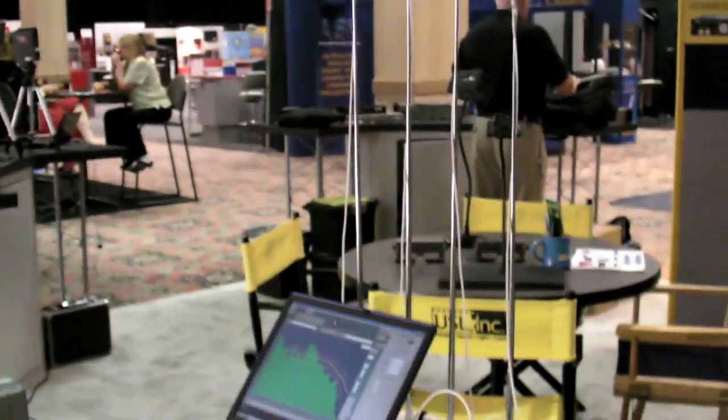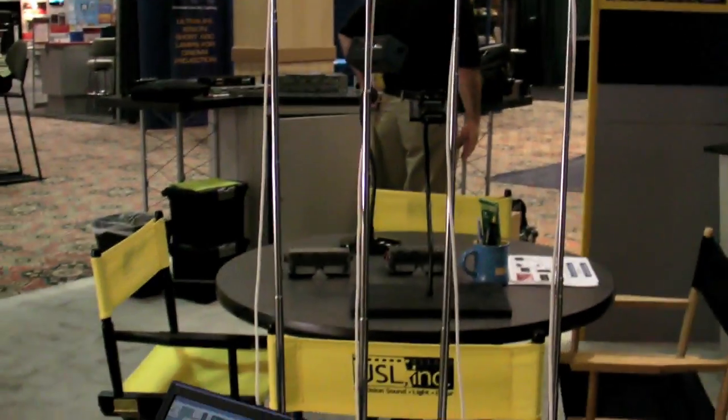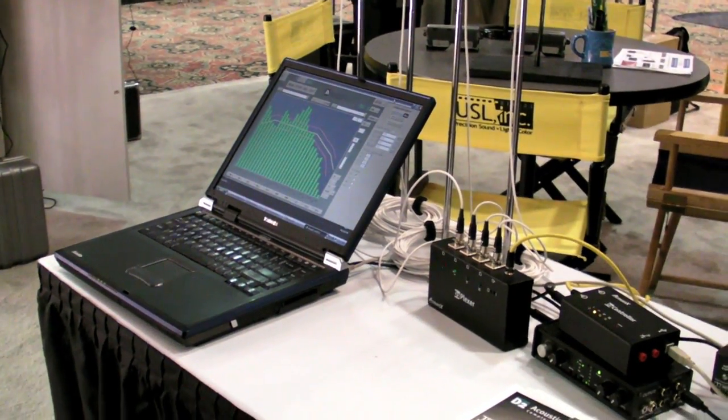Now, quickly looking at this equipment, obviously we've got the computer giving us feedback from the microphones, some sort of box where you plug them all in, and the microphones displayed here. How many microphones do you need, and where do you put them in the cinema? Many studies have been done on this, and the optimum number has been determined to be four microphones. Five microphones doesn't give you a much greater improvement. Three microphones to four is a significant improvement. Microphone one is the keynote microphone, put in the reference position, also called the Dolby position. The other microphones are gain leveled so they have equal contribution to the timbre in the room. If you put them in a diamond array, cornered in the center of the room, and average the pink noise over time, you will get a good representation of what the sound is in the room. Pink noise represents, as close as you can get, subjectively, what music and sound in a film is. So if you tune with pink noise and put it on the X-curve, you'll have a very good chance of getting an accurate sounding movie.